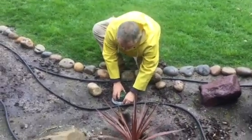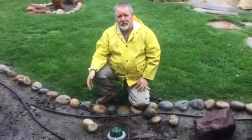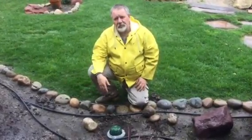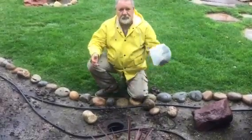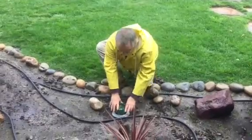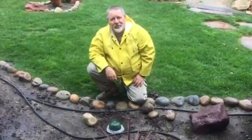Then we insert that down into the drain and snap it in place. What will happen is all that dirt and debris coming along with the water will get trapped in the strainer. When it fills up, you just pop it out, empty the strainer, clean it out, and put it back in again. That's your homeowner's tip from Atascadero, California — thanks for watching.